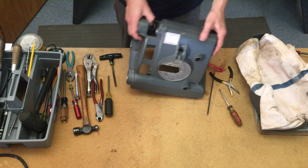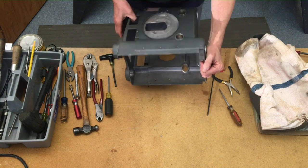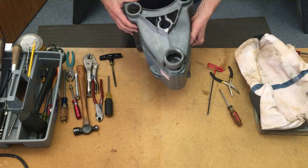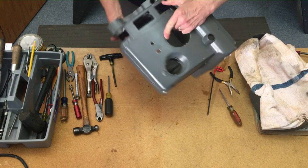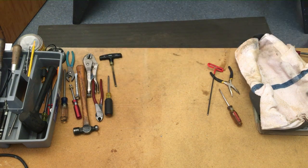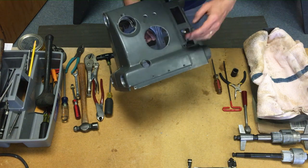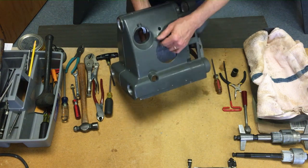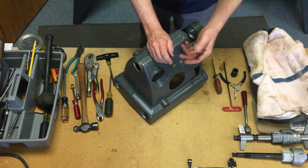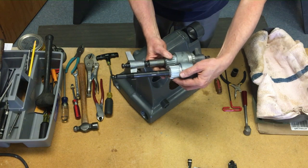Now is the best time to clean this headstock inside and out. Use something as simple as soap and water. If you've got a lot of oily buildup on the inside, you may need a solvent — mineral spirits was probably the best — then a little soap and water after that to clean up any residue. I'm going to take that and head to the sink. Now that it's all cleaned and the machining is done — drilled the mounting holes for the motor, for the power supply, and for the new thermal overload protector and fuse — first thing we're going to do is put the quill return quill feed pinion shaft back in.